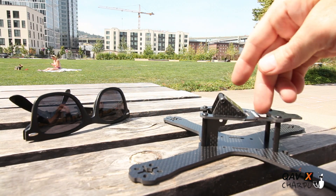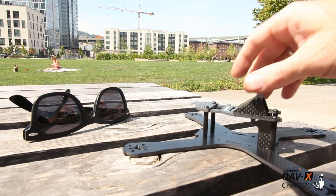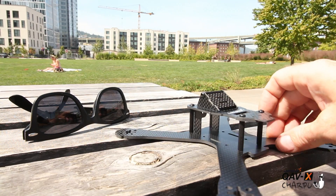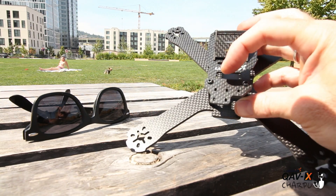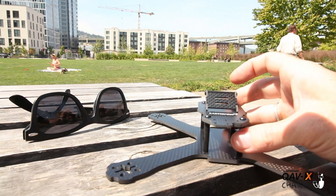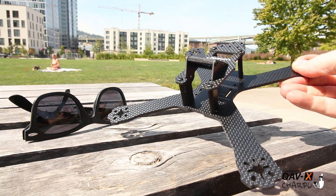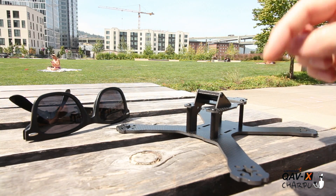The HS1177 camera will fit snugly up in here, and the GoPro mount is here at a 30-degree angle. It does have strap holes in the back so you can get a strap up and over your GoPro. You're not going to have a lot of room inside this frame to build, so I'm interested to see how my FrSky receiver fits after the stack is in — definitely going to do a pinless build because there won't be much room for pins. Out the back, there are a couple of holes where you can mount your VTX with zip ties and a channel-change hole. Very simple, clean design — I think that's exactly what they were going for.